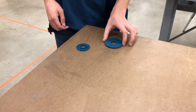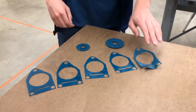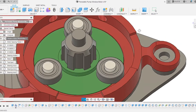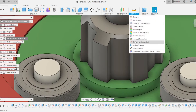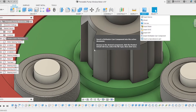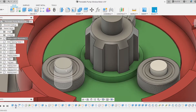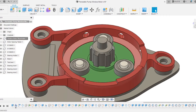As you can see on the screen, there were five test prints and two others for the other sections of this print. Coming back to the CAD, we have the lid here which we can take off, plus two other pieces — so that's a total of four 3D prints for this pump. The bearings I got from McMaster-Carr, which really speeds up the process since you can just download the part itself rather than making placeholders. These columns are actually aluminum, which we cut out on the lathe, and once I 3D printed everything it was good to go to put together.